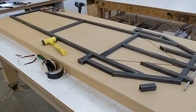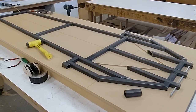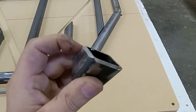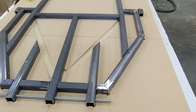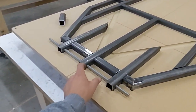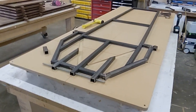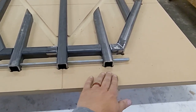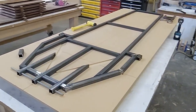The build is happening. Next steps are to go pick up that steel, get those last couple pieces cut, and then everything has to come back off. Because you don't want to just butt joint right up with a flat edge — everything has to get a little chamfer, get a good weld surface by getting some of that mill scale off the steel. Had to get a couple holes drilled — got that done today. This is a pivot, and it'd be nice if everything lined up just right. I'll probably make a jig using a piece of threaded rod to make sure the hole is all co-linear — so that everything lines up right. Progress, progress, progress.